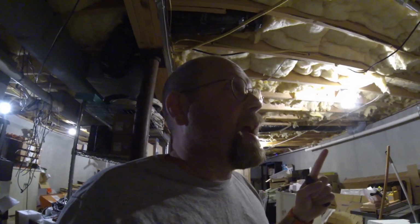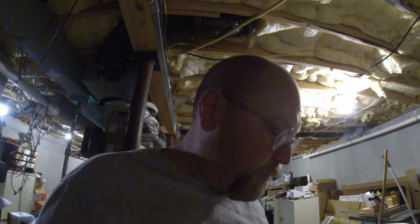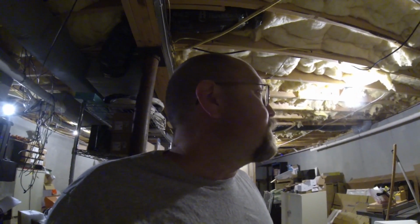And then on the second floor, I actually did put them in the wall because I was able to go in the attic. I was able to find the top plate of the walls in the attic and then drill a hole and shove them down through the stud cavities. So those actually worked out pretty well. I like the way those came out. So I'll go upstairs and show you how I snake these things through the wall to the attic, and then how I snaked them through the closets to get to where I wanted to get to.